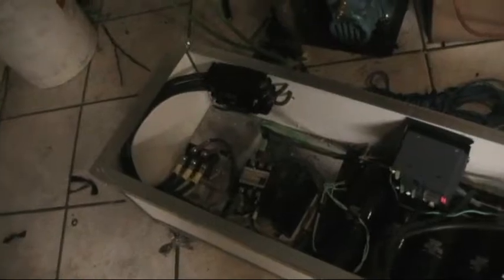So: input circuit breaker, rectifier, contactor, cooling fan, capacitor bank, that there's a drive for running a fan, power supply actually out of a PC, IGBT and gate driver down there. It's just something I designed for use in an electric car, for running a heater, or actually for running a DC motor too — it has that capability. It's a very simple setup.